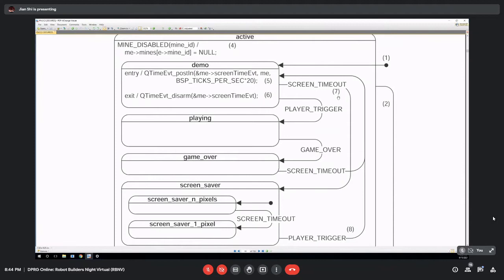I see. I would say that my experience matches Chris. Ted had talked about using state machines at the high level. The ones I use are usually at the lowest levels, where they're keeping track of things going down and are fairly simple, just a handful of states. You end up with big things, this nested if, else, then, if, that becomes real hard to debug and change. Where with state machines, it's real clean what's happening in each state and how you get from state to state.